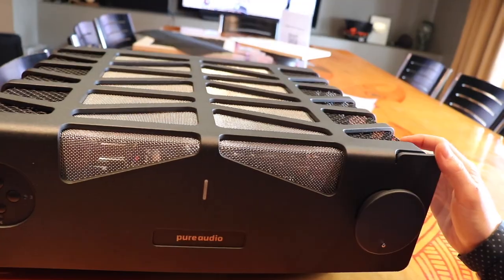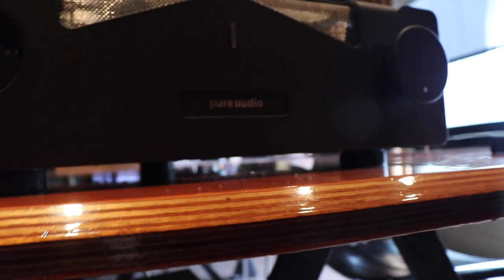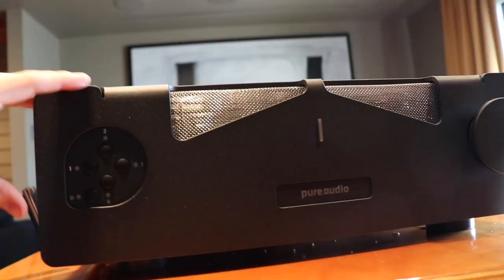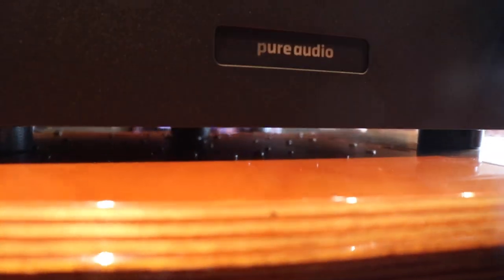The base is cut from an 8mm piece of aluminium — very, very sturdy, very strong, thick, non-magnetic style of metal. That's something the manufacturer wanted to avoid: any metals that can be magnetic. So aluminium was obviously the right choice. It has three feet as opposed to four, which is good because you get the triangle situation where you can't have any possible rocking. Because all three feet will always be on the ground — two at the front, one at the back.